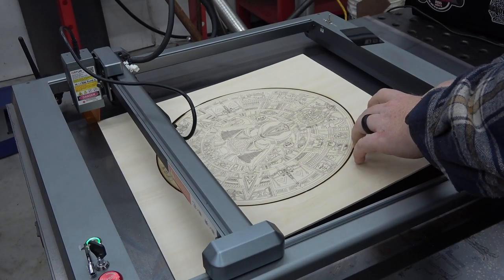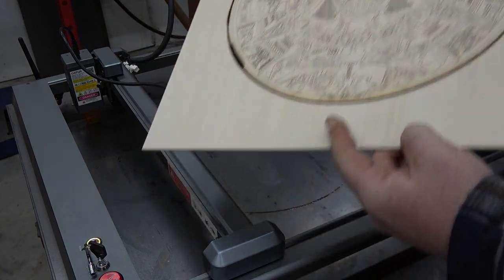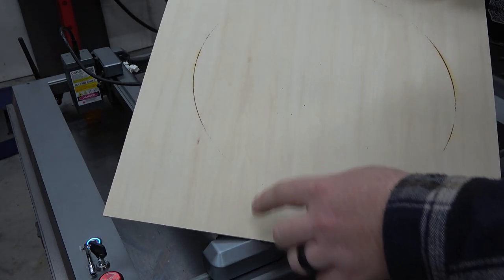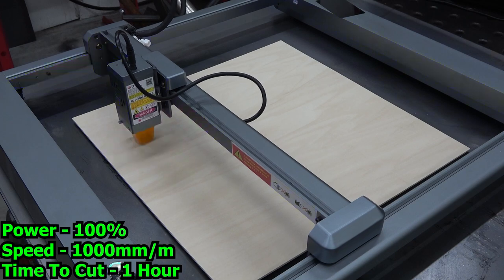You can see that because we didn't have the wood up off the table, I got some burning around the edges and the laser didn't cut all the way through the project. This is where a honeycomb bed would have been super beneficial. We're going to move on to the Millennium Falcon and we're definitely going to be raising it up with some washers so it'll cut real clean and pierce all the way through the wood.